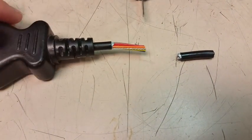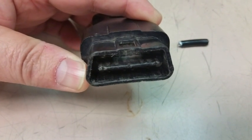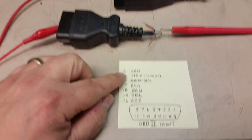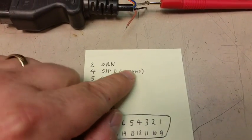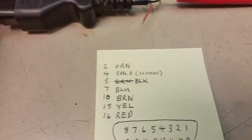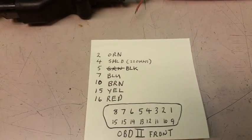The next thing you need to do is draw a diagram and get your multimeter to figure out which wire goes where. After you strip the wires back on the connector, use your multimeter to map all the wires. There are seven wires — one of them had 22 ohms on it until I wiggled it; that was on the shield wire. When I wiggled it, it went down to 4.5 ohms, so I'm confident the reading is correct now.